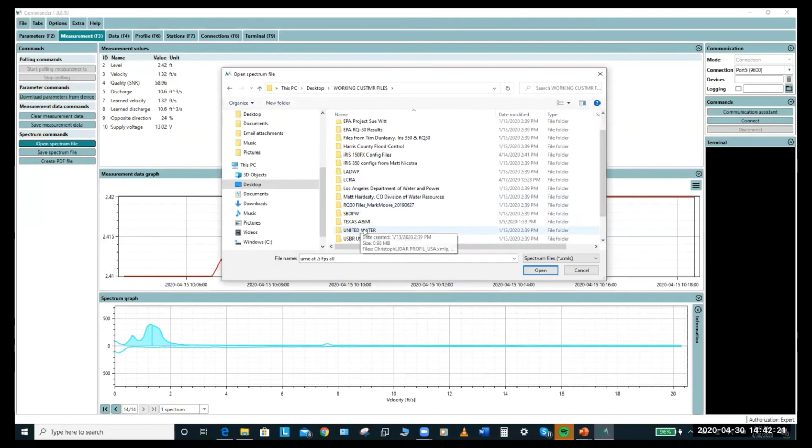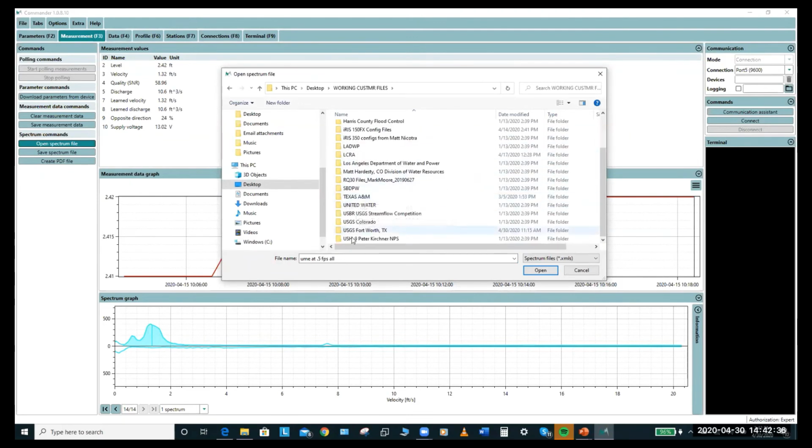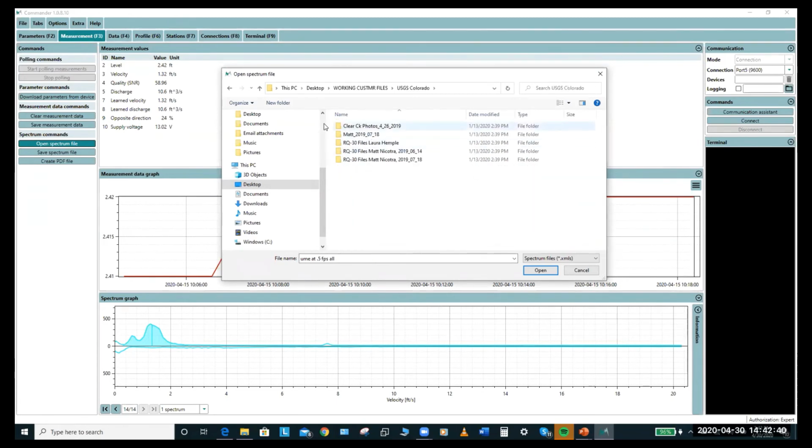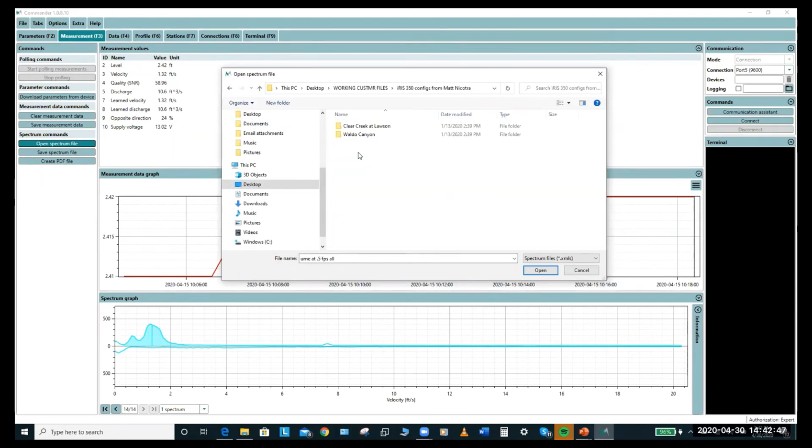One of the things we're really trying to push is ensemble approaches. If we had a discharge derived from the Summer algorithm and we use our PC algorithm and they both converged on the same number along with the PID computation, it really brings credibility to the discharge estimate. That's important, particularly since we're beginning to spin up more and more of these sensors across the US. Having three discharges that all point in the same direction would be super valuable.